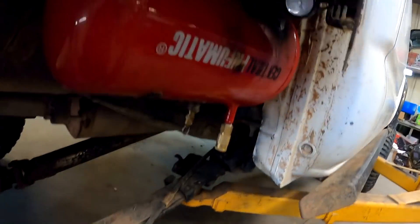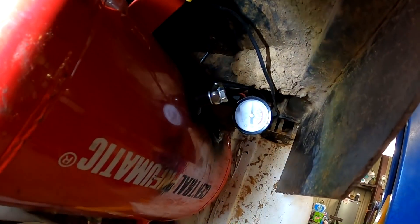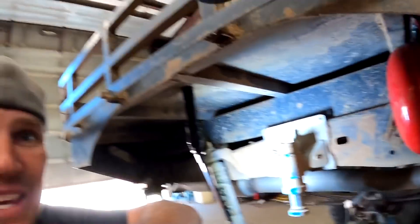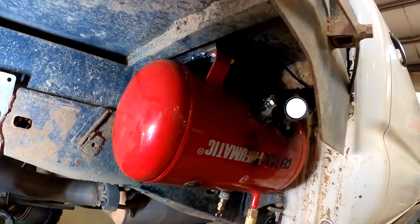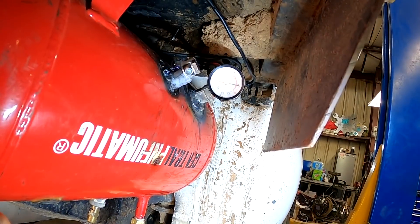I got this thing temporary — it's clattering back here. We're trying to build some air right now. It's running. I'm at 85-90 psi right now. I sprayed it with a bottle — I got no leaks. I think things are going to work out; I'll just wire the switches up and she'll be done. This thing is almost to 150 psi right now and it should kick off if I got everything hooked up right. We're just gonna wait and see if it kicks off. I got a few leaks — I can see them bubbling — I gotta pull it off and put a little more thread sealer on it. Oh, there it shut off. Sweet — that part works. Now I'll fix some leaks and we'll be good to go.